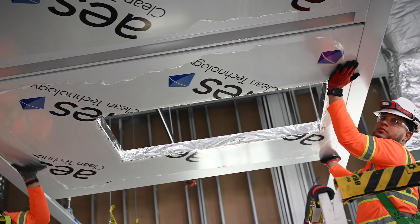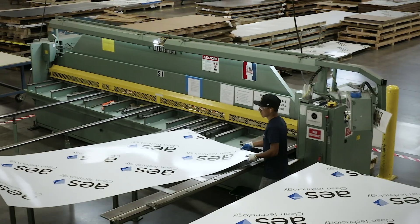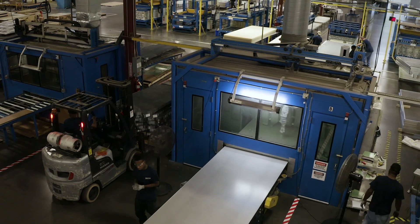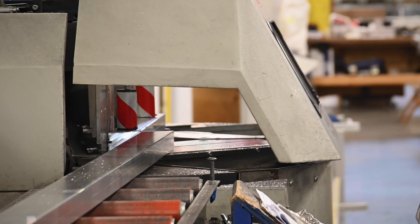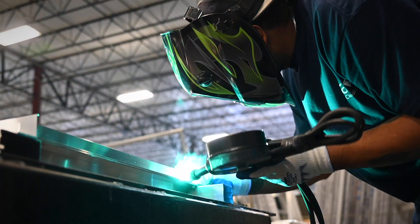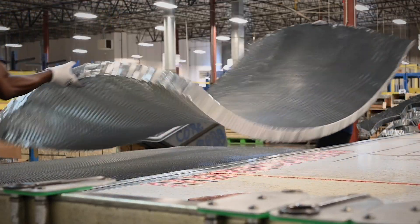All the components kind of interconnect. We'll order the components when we have a project come in — ceiling panels, for instance. The sheet goods are cut to size, the ends are roll-formed, and then those go through our glue machine. All the while that's taking place on one line, we have the frames for the panel system being cut out in the extrusion department. Then those go to the welding department and get welded up. Our aluminum honeycomb core is the filling for all of our systems.